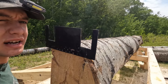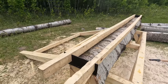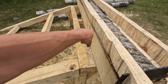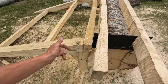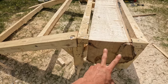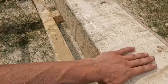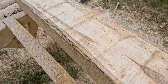Secure our two plates and, you know, it's not much to it. Okay, so now we cut, but I should have the saw running this way, and I might still, because it's easier if the mill rides on the flat surface than on this surface, so I might cut from this side. I should have it flipped the other way, but it's okay. You'd see we got her good and square, she's 90 degrees and looking good. See, we just grabbed a touch of bark here without wasting too much, so that's right on.